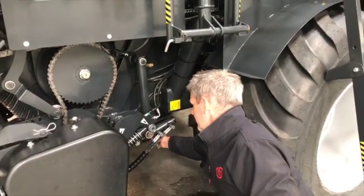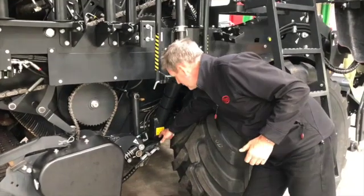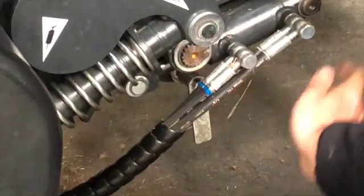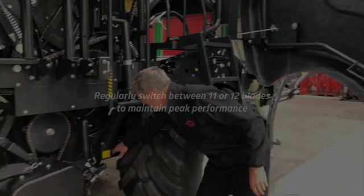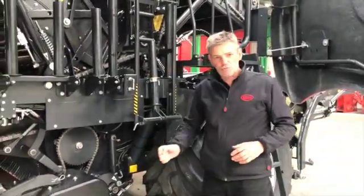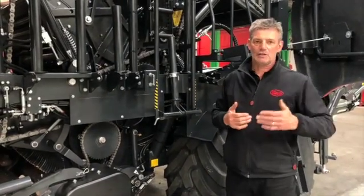We would normally recommend in the UK cutting on either 12 or 13 blades. To select 13, simply pull the handle and rotate it until it clicks into the position indicated for 13. Then if you take out the two outside edge blades, it gives a nice firm shoulder to the bale. You must do this with the blades lowered — pull the handle out, rotate the rod around, and drop it into the position for 12. Then you're ready to go with a fresh set of blades.